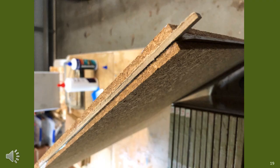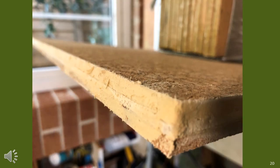In this case, it looks like the MDF board is too high. In reality, it's the correct size for one side, but on the other side, the cork tiles are not lined up correctly. I did not leave a gap to align the cork tiles in this case, which was an error on my part. Use a rasp to smooth down the MDF board, insert, and then apply wood putty and sand. This shows the resulting edge with the inserted MDF board, rasped down and covered with wood putty. This will be smoothed down when the wood putty is dry.